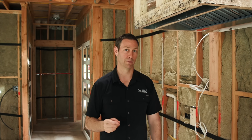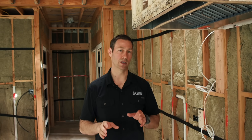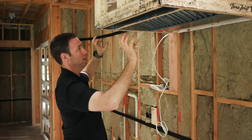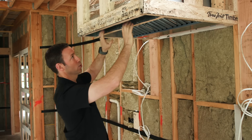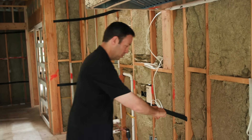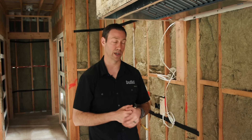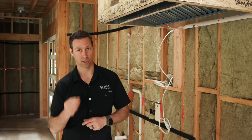That's why we want to put that filter on there. I'll put a link in the description to a couple of the products we used here today. The biggest thing you need to decide before you build is where this make up air is going to be located. If you've got a hood like this, we're just going to slide our exhaust fan back 2 or 3 inches and put that duct here. If you have a downdraft or another setup, you might consider putting that behind — but that's going to take some coordination with the builder and the architect ahead of time. By putting it right here where the hood is going to capture that air and send it right out, that's the perfect place for it.